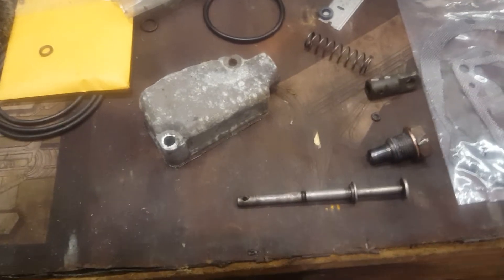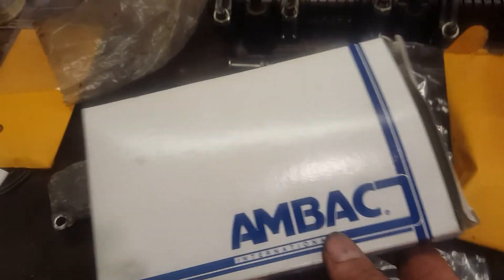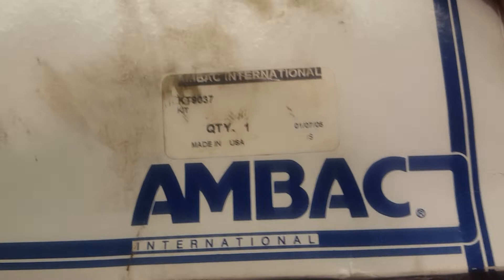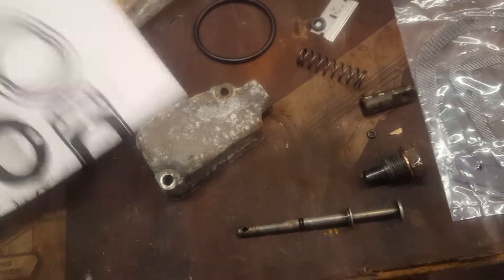If you've got a leaking issue you can either use a very small o-ring out of a kit to address that, or use a complete AMBAC gasket set. I have a complete American Bosch injector pump gasket set here — the part number is KT 9037 for the multi-fuel injector pump complete gasket and packing kit. I'll open up the contents list so you can get a look at it.